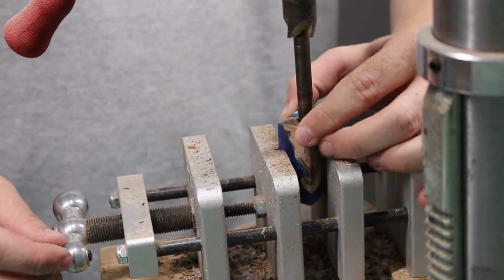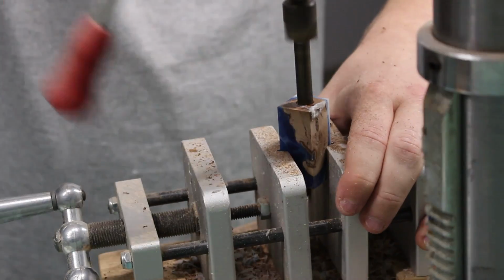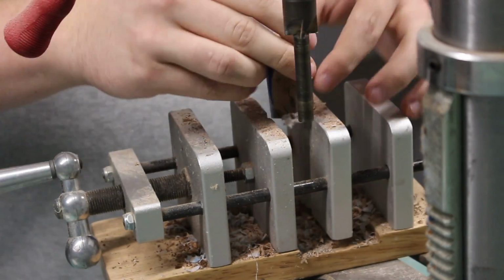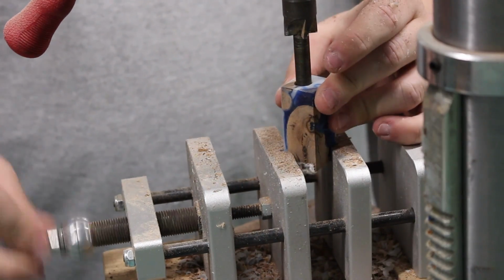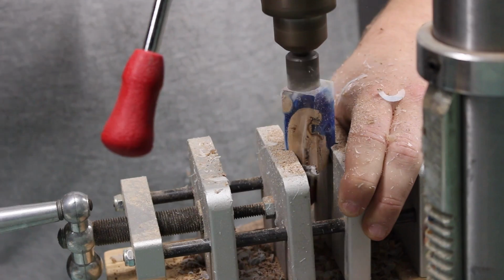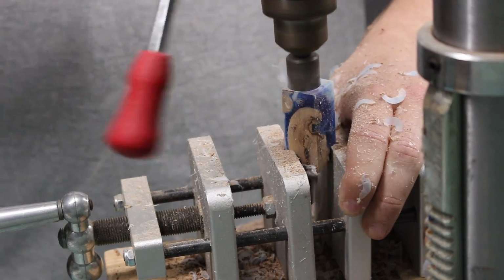But getting back to what I was saying, what's nice about it all being a one size tube is the barrel trimmer as well as the drill bit can be the same size, so it makes preparing the blank a lot easier and also, more importantly, a lot faster.